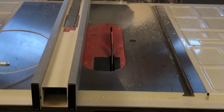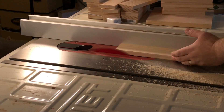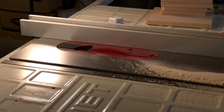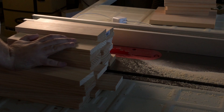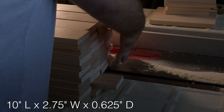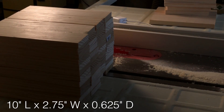The whole point of doing this is to make sure that you've got four 90-degree angles, so keeping track of where those angles are is really important. And now I'm going to run these boards through the table saw to make that last edge perfectly square, so I've got boards that are all dimensioned and perfectly square for optimal glue ups. The final dimension ended up being ten inches long by five-eighths of an inch thick by two and three-quarters inches wide.